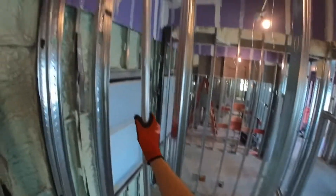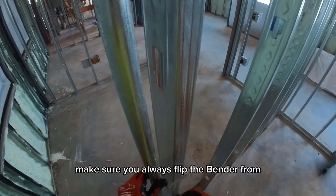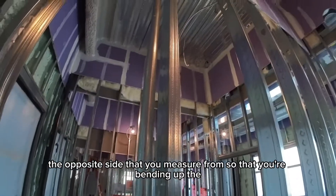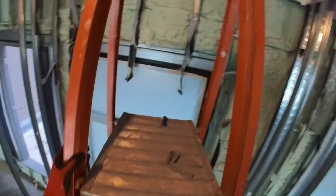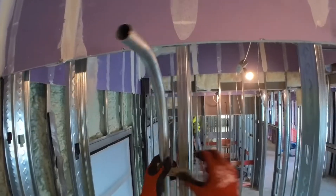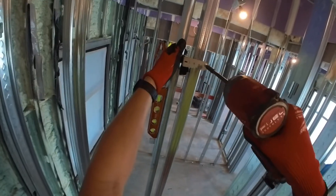Make sure when you're using the star: one, make sure you don't do a deduct; and two, make sure you always flip the bender from the opposite side that you measured from, so that you're bending up the opposite side that you measured from.